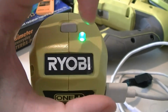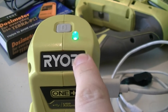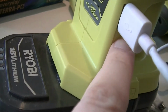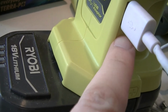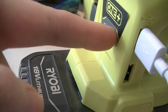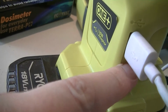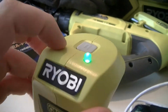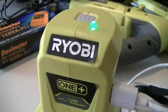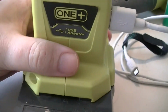And also note where it's installed. That's because there's a free space down in there for the leads and what have you in this particular area of the thing. You might also be able to stick an LED there if it's a T1 LED. But right about here there's an electrolytic capacitor for the output of the switching converter that generates the 5-volt rail for the USB ports. So there wouldn't really be room for one there. But here, possibly here, but again there's a reinforcing rib right there. This is just the easiest area to put the LED in.